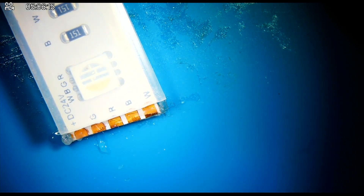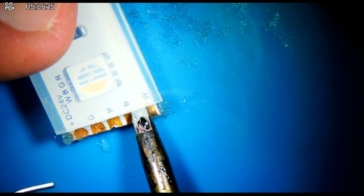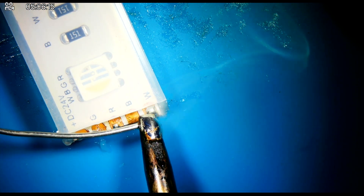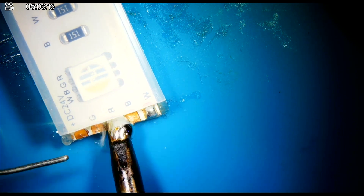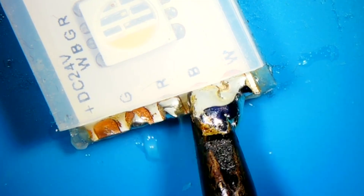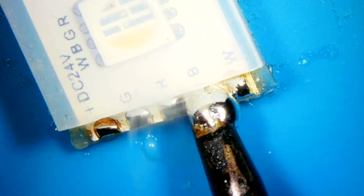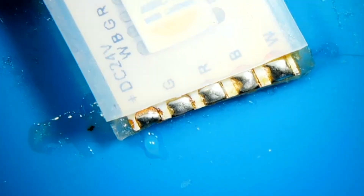Now you might see that there is still some stuff on the copper. Be super gentle here — I try to not use the sharp end but this side here and try to get rid of all the plastics. You see there is still stuff coming off. Maybe with the fingertip it's safer. It's the same process as always — I use my flux, I cover the tip. This is the problem I face a lot with them: if you don't get rid of the plastic it's a bit hard to make a good bond. Here you see the first and the third one went pretty well. Now with the flux it works like magic.